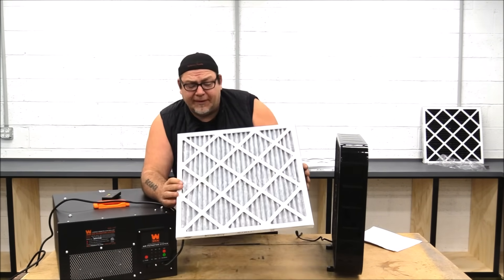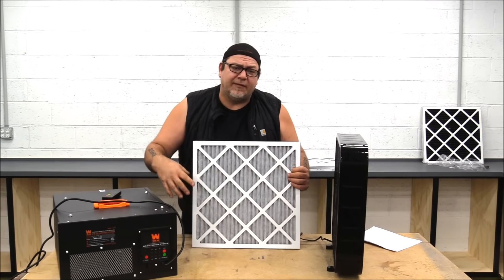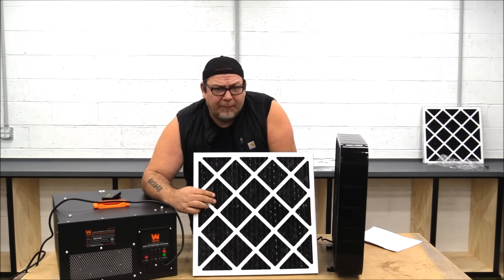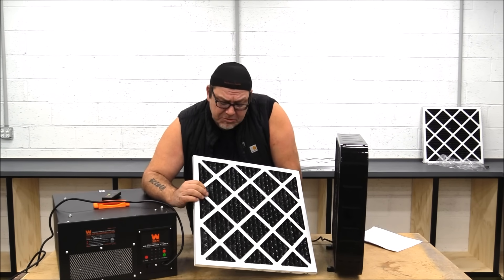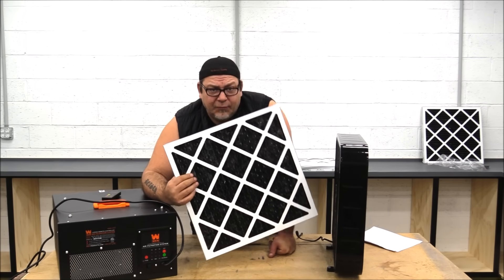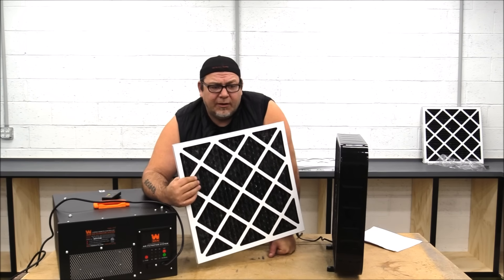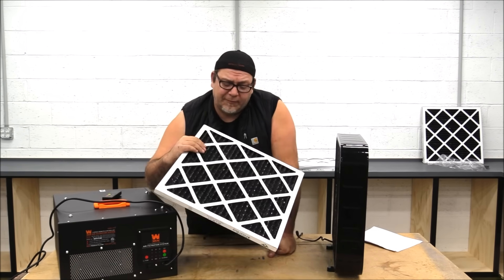A box fan with a couple of air filters filters more air than the traditional unit does. A typical filter is pleated because that more than doubles the surface area, giving it a lot more area to catch particles. It has metal on the back for electrostatic purposes — small particles are electrostatically charged, so they're attracted to it, which helps catch more particles. This particular one also has charcoal or carbon on it, which really helps with mold spores, allergies, and smells. If you work in a wood shop and use different species of wood, sometimes they smell good, sometimes they don't — but that carbon filter is pretty nice.